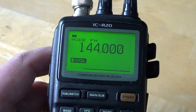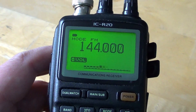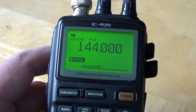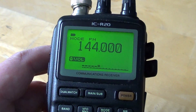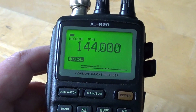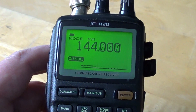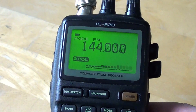For most scanners, the interesting part of the amateur radio band will probably be more interesting from 145 to 148 MHz, where lots of FM repeaters and amateur radio stations are mostly in FM on these frequencies. So for most scanners, that will be the best part.